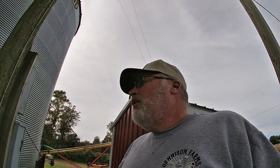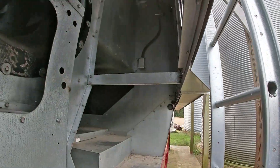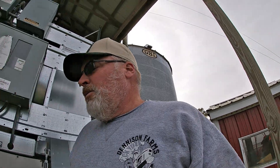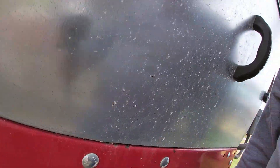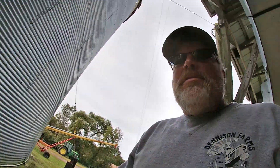I just greased the bearings underneath for the inside conveyor that takes the corn back. I climbed in here and greased the big shaft on this side of the fan, then crawled through the little cubby hole to do the one on the other side rather than take the shield off. It's up to here on me, so it's just as easy to crawl through the space. I gotta sweep this cement up too — freaking bird shit from the summer.